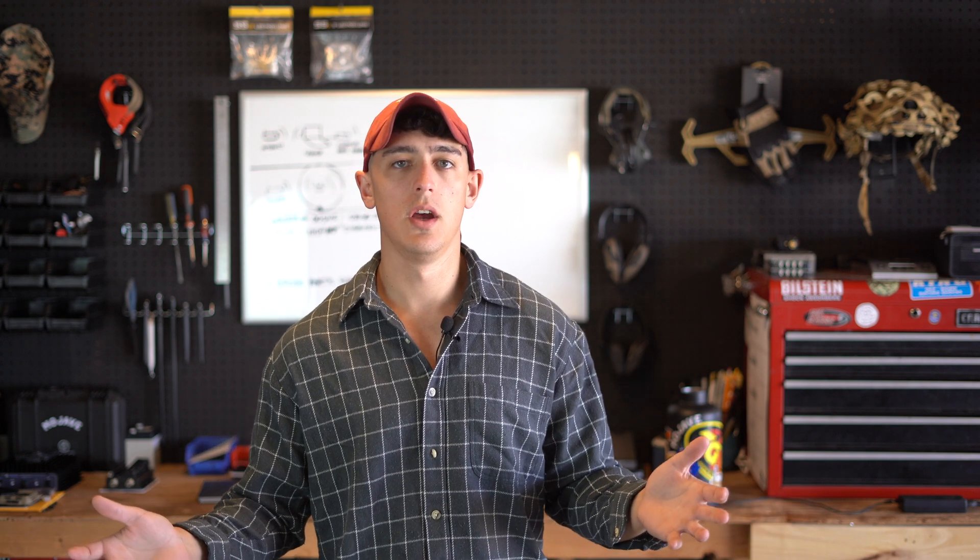The Lunchbox is what's called a simplex repeater. It comes from the military concept of a retrans station — or retransmission station — where a team parks themselves up on a high piece of terrain to retransmit signals from one side to the other, effectively increasing range. By simplex repeater, I mean it operates on one single frequency: it receives transmissions, records them, and retransmits them. A duplex repeater, by contrast, receives on one frequency and automatically forwards to a second frequency.